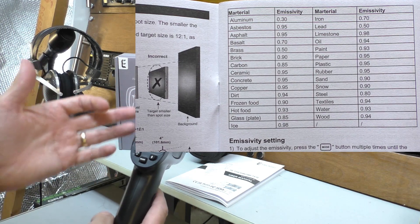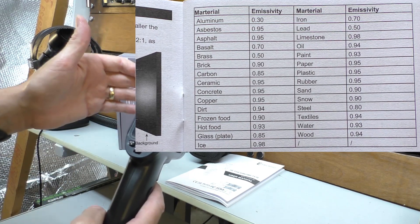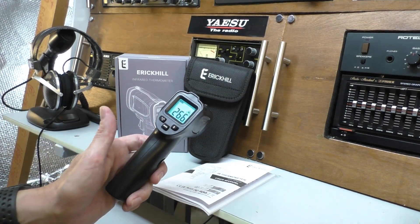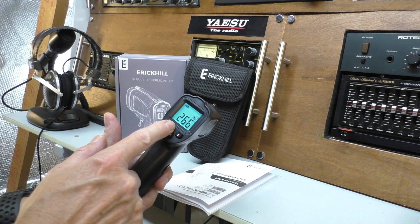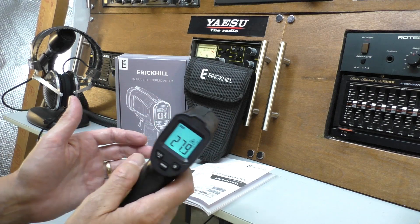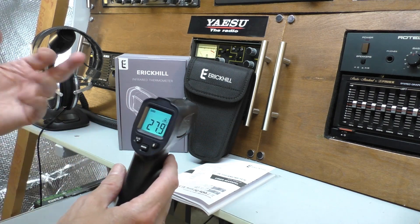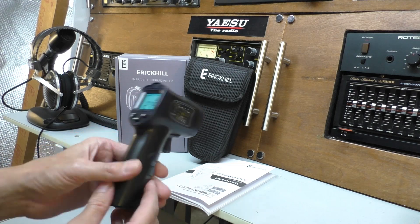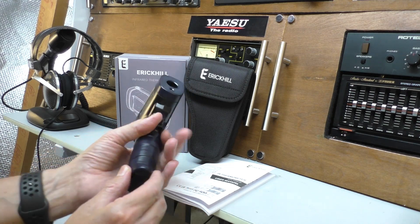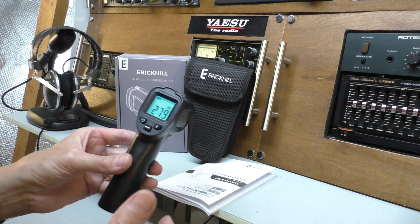Accuracy-wise, it says in the book that from zero to 100 degrees it's accurate to 1.5 degrees centigrade. There is a calibration setting — it's auto-calibrated when you get it, but you can manually set the calibration, and there's an emissivity scale for certain materials you test all the time which will improve accuracy even more. Other menu options include turning the backlight on and off, and the guiding laser can also be toggled to save battery power. The batteries supplied in my cheap original unit are still going.